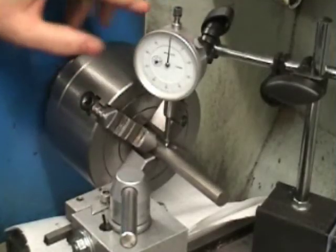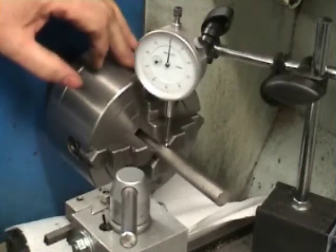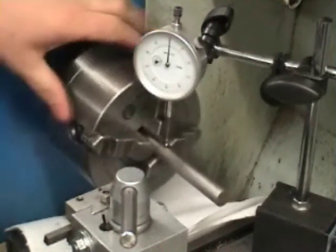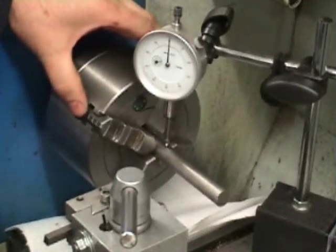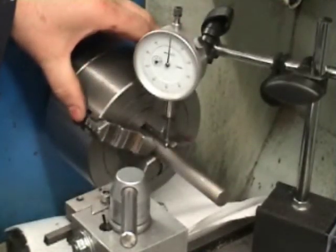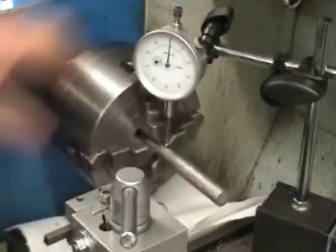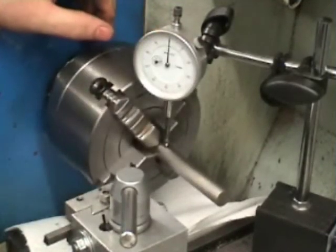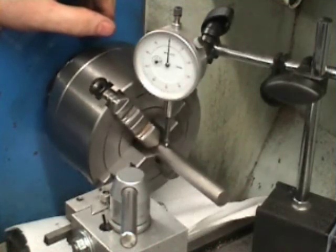The highest point on the gauge — whatever the jaw is — you go to the opposite jaw, loosen the opposite jaw, and tighten the highest jaw. If you come between two jaws, as you will do, then you simply note the two jaws you've got highest, go to the other side, loosen them off a little, tighten the two at the top, and then see what you're out of again. And that's how you do it. Any more information, just go to Mike's Models.com website where there's lots of information for you. Thank you.